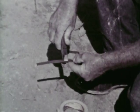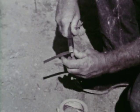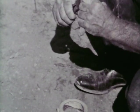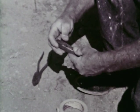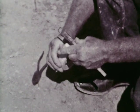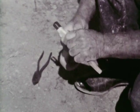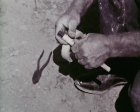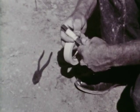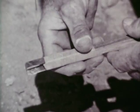100 square inches of finished Keystone Kool Deck. The proper tool for knifing deck into stone pattern. A banding strap, 5/8 inches wide and 8 inches long, is centered 90 degrees to pliers, forming letter T. Bend both ends down so that banding strap is in the shape of the letter U. Banding strap is taped to open end for the knifed out chips to fall through.